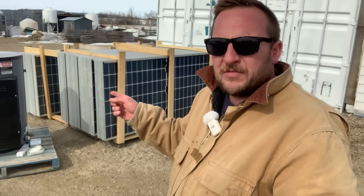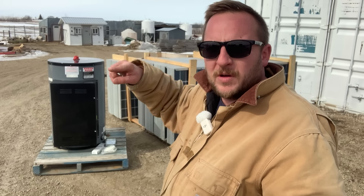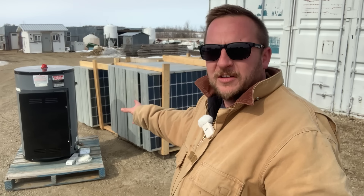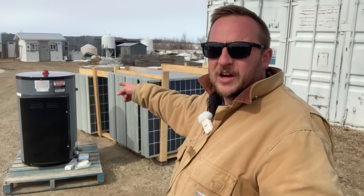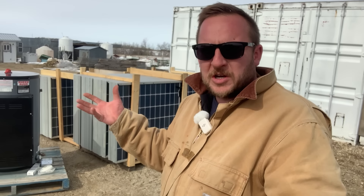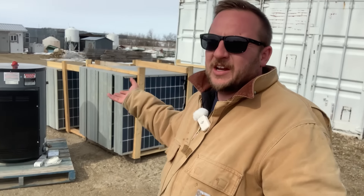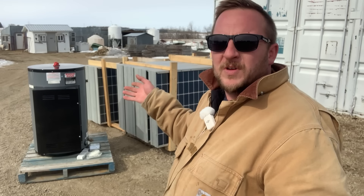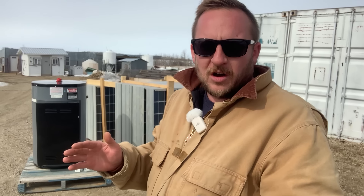What's cool about PV direct — I'm going to fill this water heater with probably glycol, maybe just water, and run a circulating pump through my concrete and the additional tanks. I have to size how much extra tank storage I need, because instead of doing a shutoff when the water gets too hot, I want to collect as much energy as possible. Any additional energy will heat more water or glycol in simple IBC tote tanks.